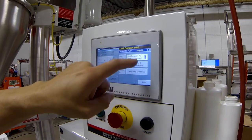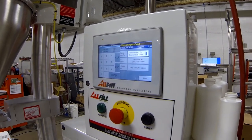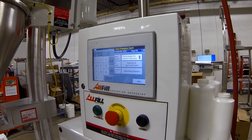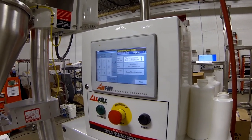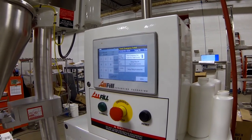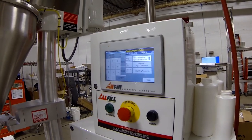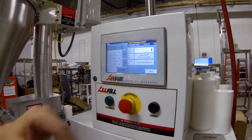Containers per cycle — this is where you pick how many containers per cycle you're filling. We're going to be filling two. You can change that to one if you wanted to index one bottle and do 50% of the fill on each head, or 75/25, whatever it may be. We do give the option to go to four because sometimes you can split the flow of powders to two jars off one auger. That doesn't work well for your powder, so this will either be two or one for you folks.